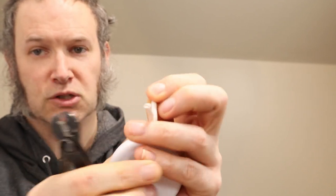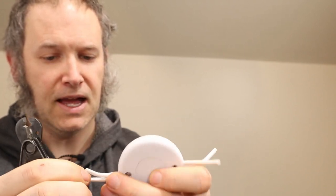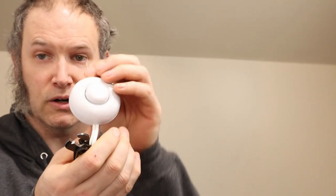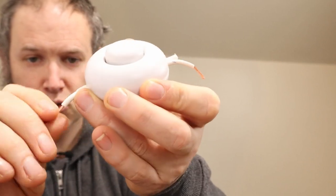I've marked the wire that has the switch in it — that's the only wire I'm going to need. Use some wire snippers to split the wires apart a little so you can get access to the wire you need. Strip the marked wire on both sides to expose it. Now I've stripped both sides of the wire that has the switch in it. Cut away the unused wires so they're not in the way, then twist the ones you're going to use.